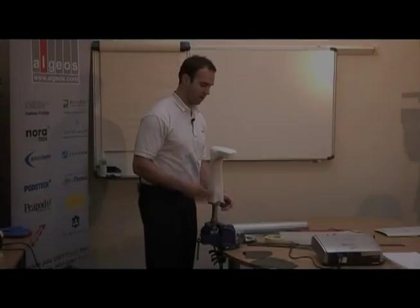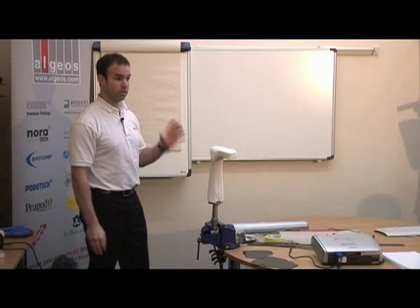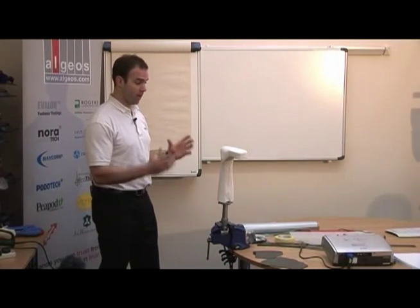We take a regular plaster mold. We recommend that you dry it for as much as 12 hours at 50 degrees Celsius in the oven — basically dry it as much as you can. It's not something you have to do, but it will help.